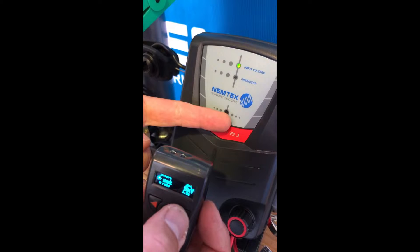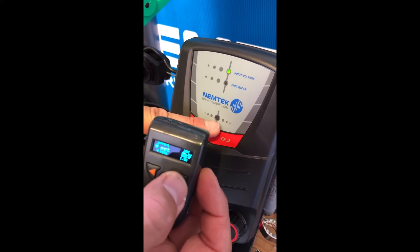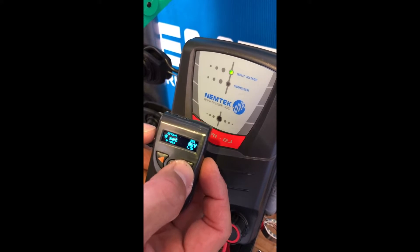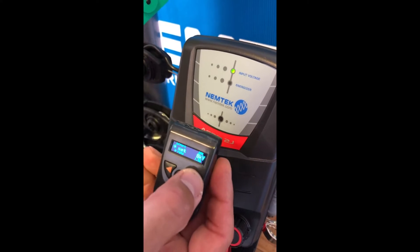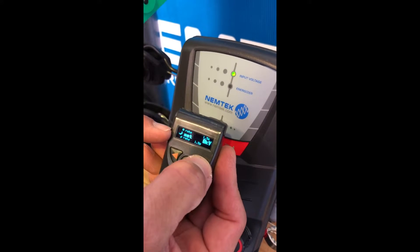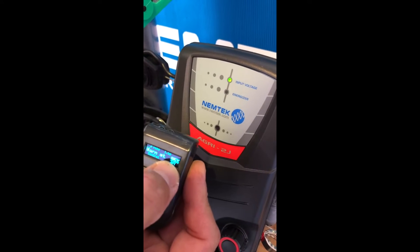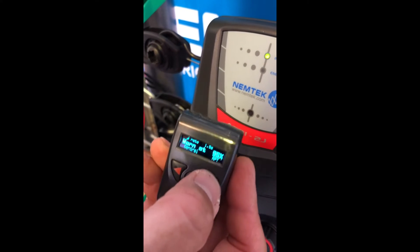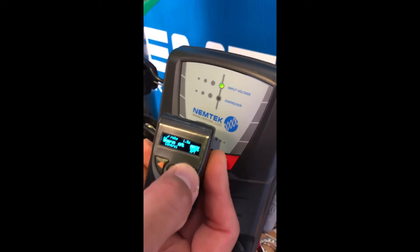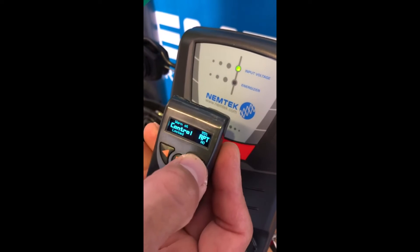There's a day setting and a night setting. On the energizer we have photo sensors which differentiate between night and day. You can utilize this programmer to change the settings from day to night. The moon icon represents the night settings. It will warn you at 95% effort via double flashing. The energizer has APT technology, which I will explain later.